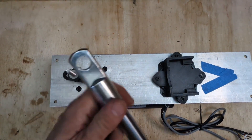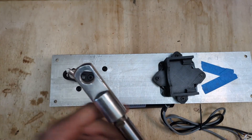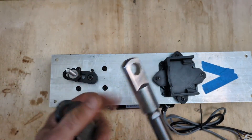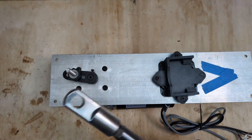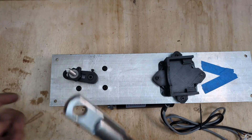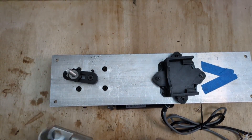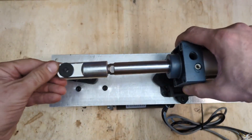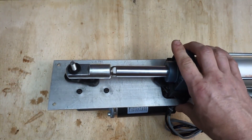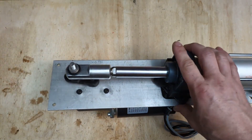So I'm going to use an M16 clevis. The rod's M16 threaded. Normally I use a Y clevis — they're actually half the cost of these, about $6 each versus about $12. Not a big deal for one. I just printed a reducer to take the 16mm hole to 8mm for the carriage bolt, and it just pops in. Now we can put this on, with another thrust bearing on top, and a nut.